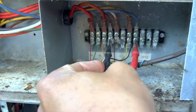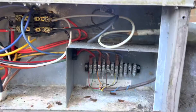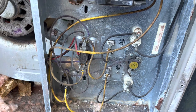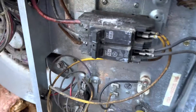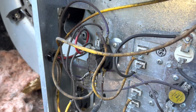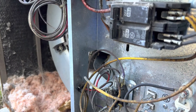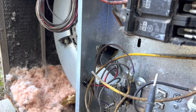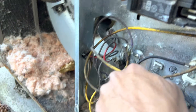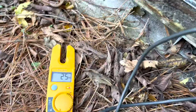So now we're gonna go from common to white. We have a call for the heaters on common to white, so we're going to go down here and see if we have 24 volts on the heat strip sequencers. We're gonna go on the coil — coil on these sequencers on the bottom. There's one there. Let's get one lead on there like that and one lead on there like that. Okay — we have 25 volts on the sequencer.